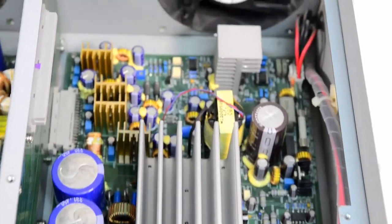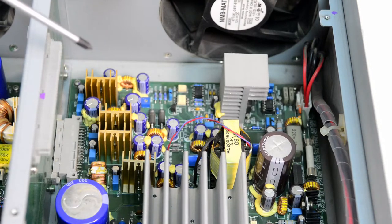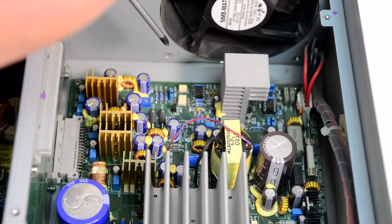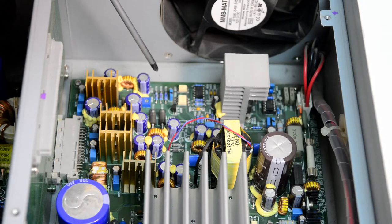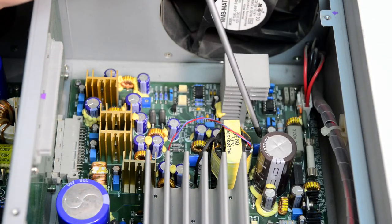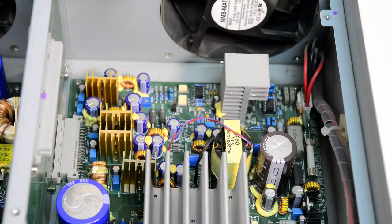There are some control circuits over there. Then I think that is the low voltage regulator for all the digital power, like for the controller, ADCs, analog low power rails. Some heatsink stuff with, let me check, there is a test point, iSense. This is an LM393 comparator, some trim pot. This actually I see is socketed, 450 volts, 220 microfarad cap. Another fuse over there.